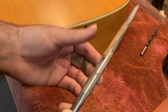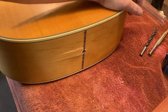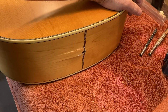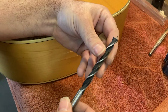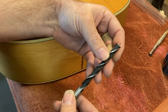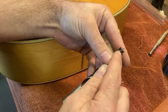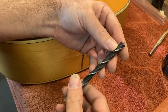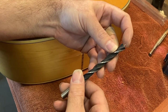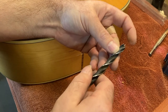But you may not want to spend $60 or whatever these things cost, and you may want to do something a little bit cheaper — that's totally understandable and also possible. I'm going to show you a couple of alternative bits you can use for drilling that hole. The first would be a brad point bit. This is a bit that people who aren't carpenters probably aren't as familiar with as that twist bit. You'll notice that the tip is shaped quite differently — you've got a little point in the middle and two little pointy things on the side. This is a drill bit designed for precision drilling.